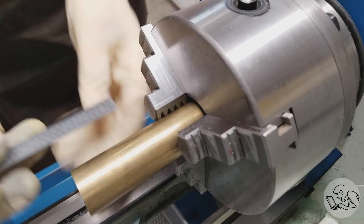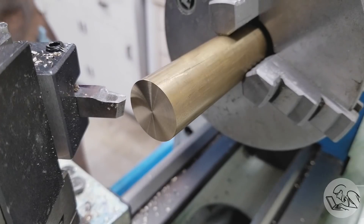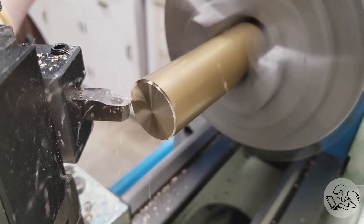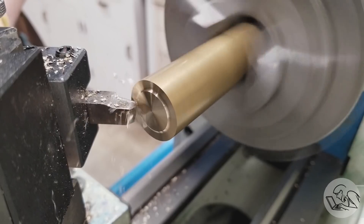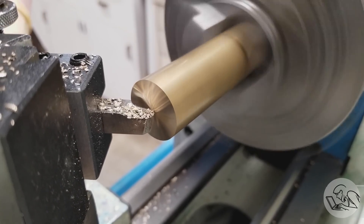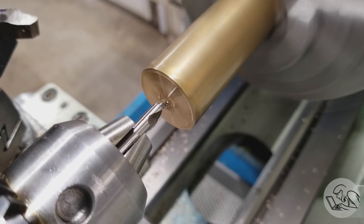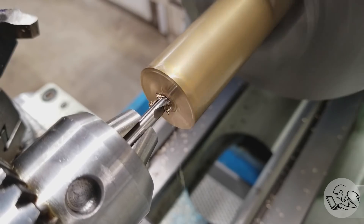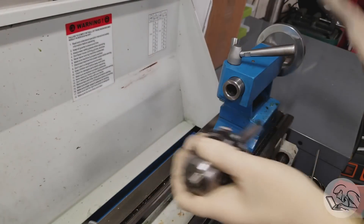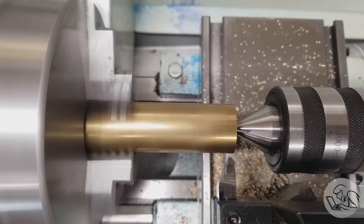We can chuck this up in the three jaw. This is a very simple part — we can make it all in one setup so the three jaw will serve us well. One issue with this bar stock is it has quite a nasty bend in it — look at that runout. So I'm going to face it off, and I've got it pulled out to the final length I want. I'm facing it and center drilling it while it's pulled out like this. What this does is put the center in the position where the stock is riding with the bend in it. Because it's found its center out here with the bend, it'll run without vibration and we can turn the bend right out of it, just like you would with a part that's out of concentric.